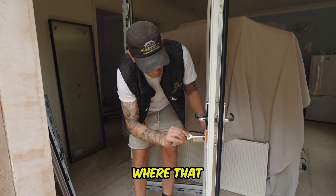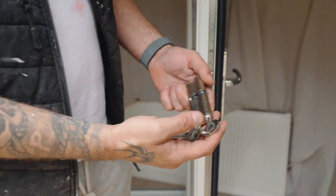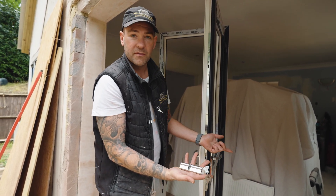So you need to find that position. When you've got your barrel out, when you've finally got it out, this hole — as you can see on this barrel — is set further over this side than it is that side. It's not half and half.